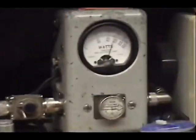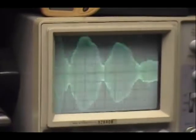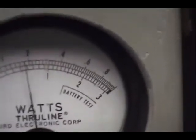Audio check, check, check, check, check — 1, 2, 3, 4, 5. Nice waveform on the scope, no flat topping, no over modulation, and a nice clean almost 30 watts — 28, 30 watts.